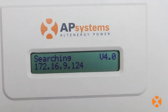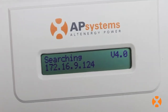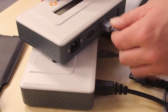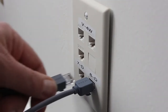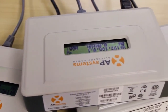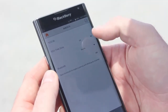Finally, when initially connected to the internet, the ECU will immediately begin downloading the available firmware updates from AP Systems. This ensures that you have the latest software to track your solar array performance. To save you time, the ECU can be connected before the PV modules are installed so that the updating is completed by the time you're ready for commissioning. The ECU can then be synced up with the microinverters and the cloud using the AP Systems Array app, which we'll cover in our next video.